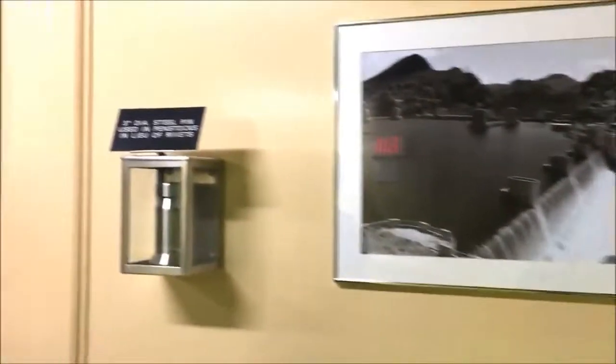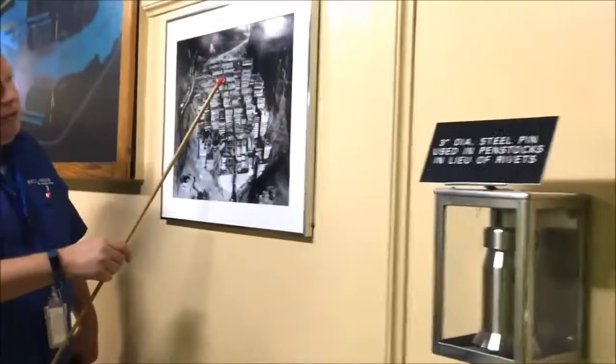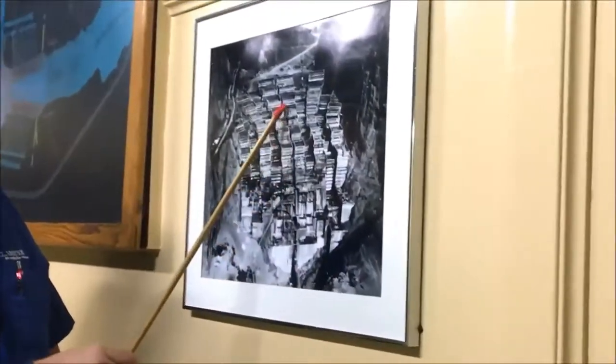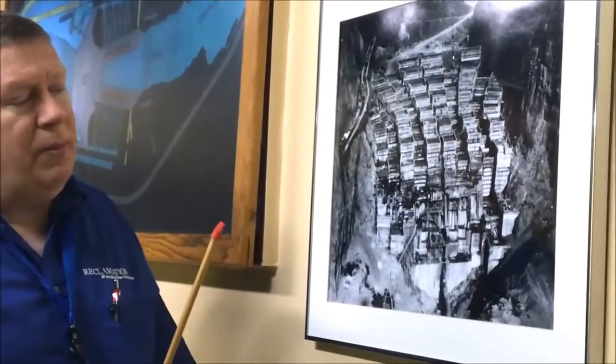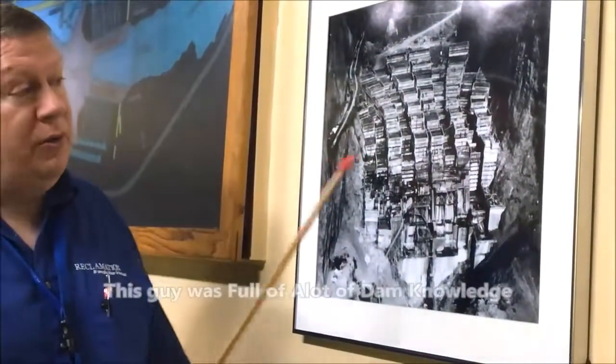Once they started forming the concrete, they came up with another major problem we talked about a little bit downstairs. Concrete is a chemical reaction. It sets up, gets hot. They built that 1,000-ton ammonia plant down here, ran 1 to 2 inch pipes through each form. There's a main pipe that ran up the center 8 foot slot, ran 1 to 2 inch pipes horizontally, vertically through each form, cooling a form by pumping 38 to 42 degree water through it.